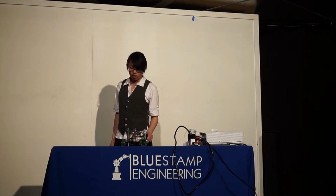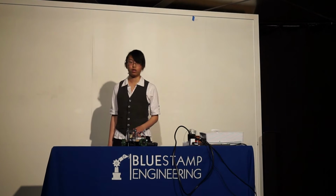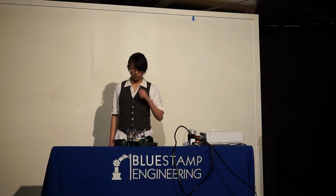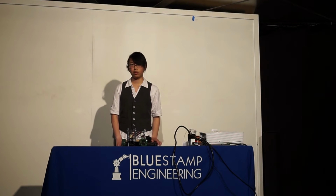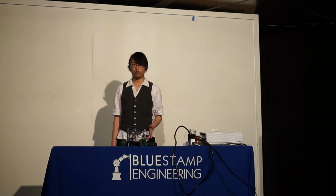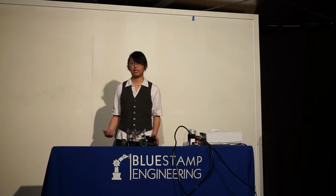The motors, along with the sensors and the battery, are connected to the Arduino through a perf board, which is a board that lets me solder in the wires and the parts permanently, so nothing falls out. The battery that powers the Arduino is 7.4 volts, and through the Arduino, the receiver and the sensors are also powered. The motors also use the battery to get power instead of the Arduino, because the Arduino can't handle the current that's needed to power the motors.